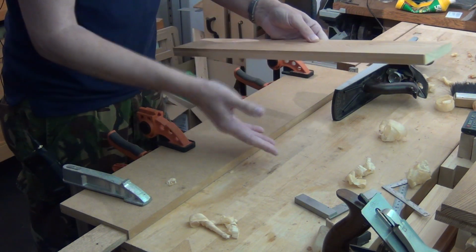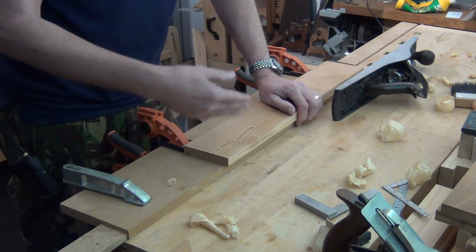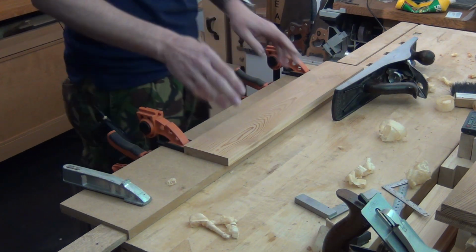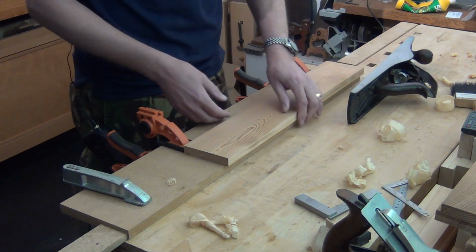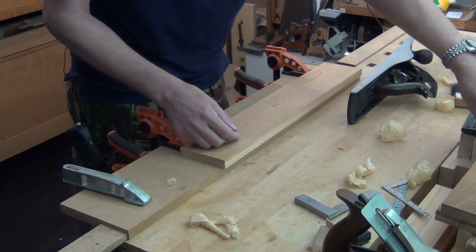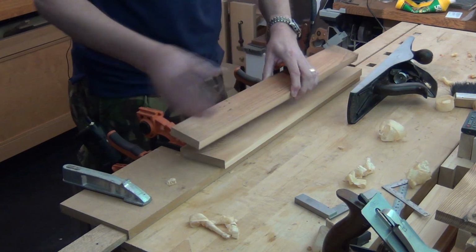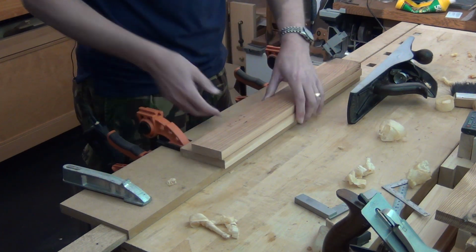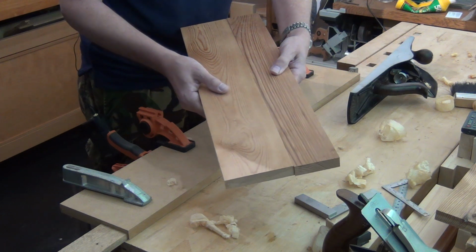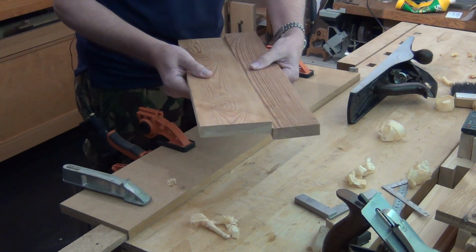Turn it round, keeping the same registering face at the bottom, and do the other edge. And then if you do the mating boards the same way, you should find they go together perfectly. If you're having problems getting it entirely square, you can plane one side of one board up the right way and then flip the next board upside down, and that way you get the same effect as doing a butterfly planing. And you'll find another video of that in my channel somewhere, because if you plane two edges that have been butterflied together, they'll always come nice and flat as well.